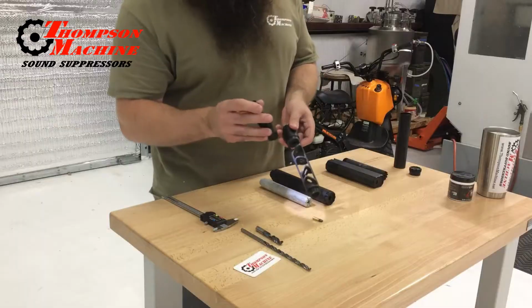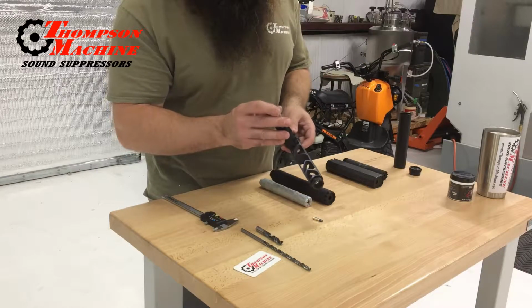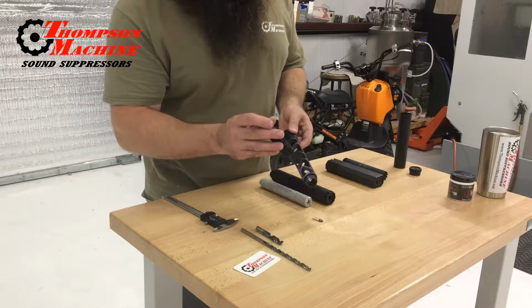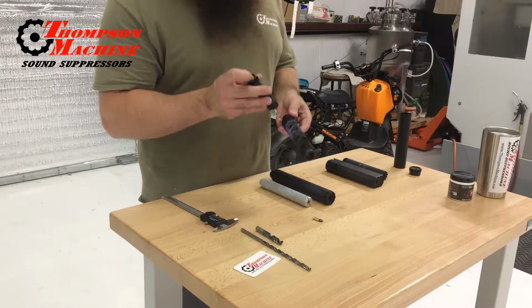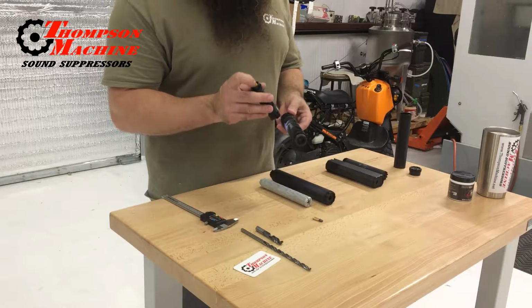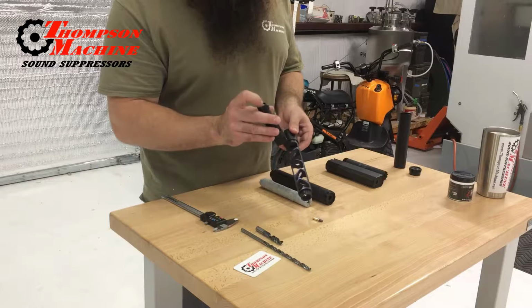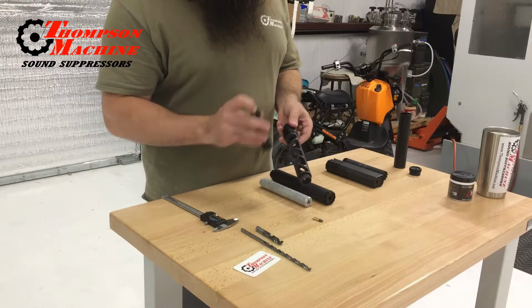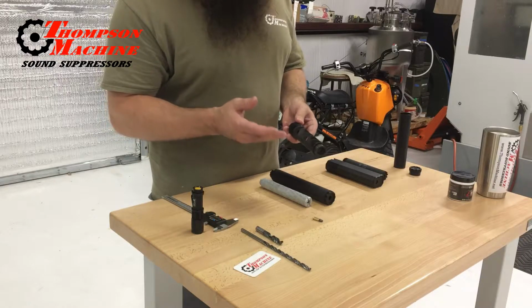Now, I don't know how well you guys can see them, but there is actually material displaced and deformed in this core. We use this core in the shop still as a shooter core. It's still functionally just fine, but it has some gouges in here from the projectile striking the baffles, and I would classify this as a pretty bad baffle strike situation.